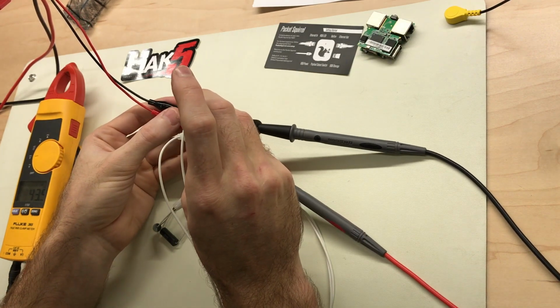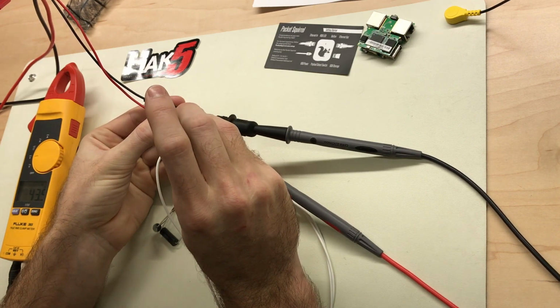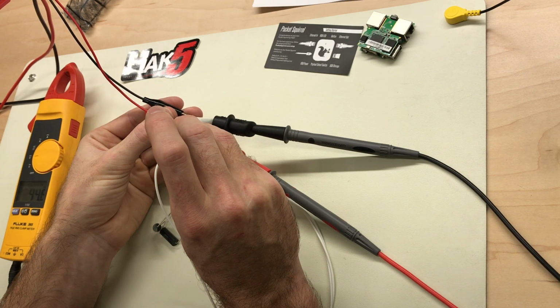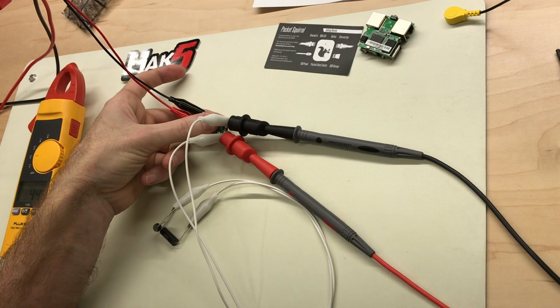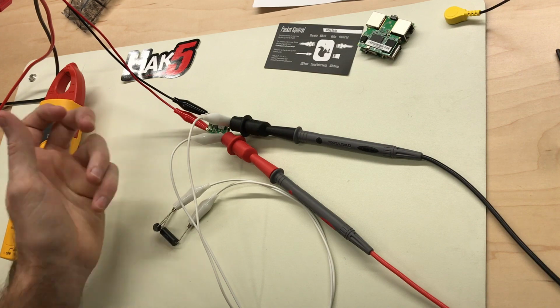So I'm going to drop the output voltage down. And I know you can't see the other meters, but right now it's sitting at 5.5 volts output. And I'm dropping that down to about 5.1 volts. All right, so we're still holding, outputting 5 volts, 48 volts in, and the board is drawing 1/4 of an amp on the output.